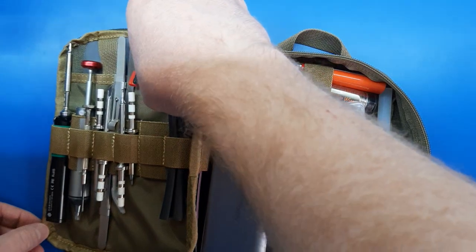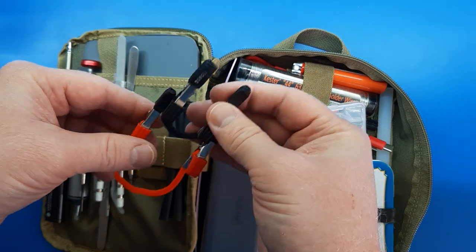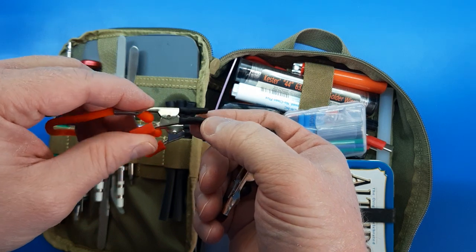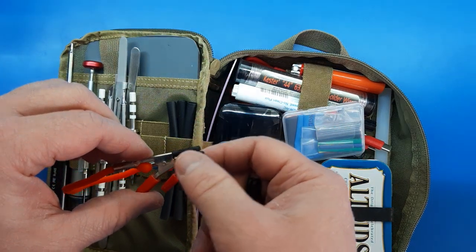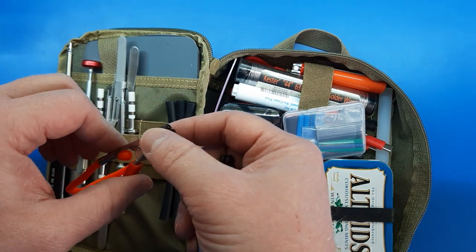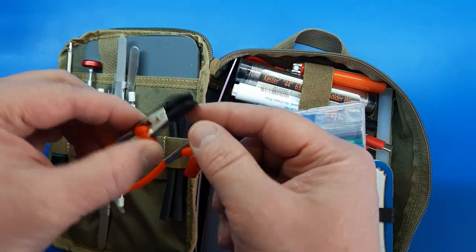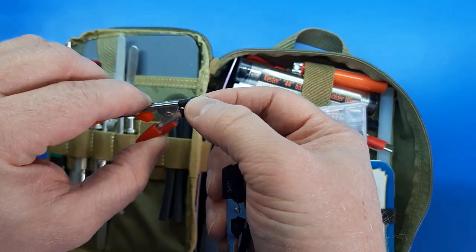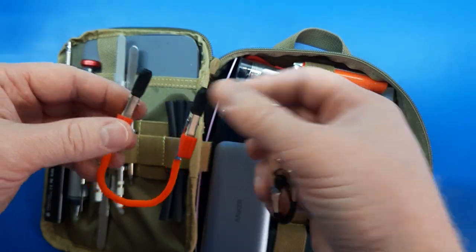Next up, the helping hands that I made. I had used them and realized that the gripping strength, especially when you're soldering something, caused the alligator clips to bite into and penetrate the PVC or whatever sheathing is on the wire, leaving unsightly bite marks and tiny punctures. So I put a couple layers of heat shrink wrap on them so they don't have any hard bite now — they still hold just fine but no longer mar what I'm working with.